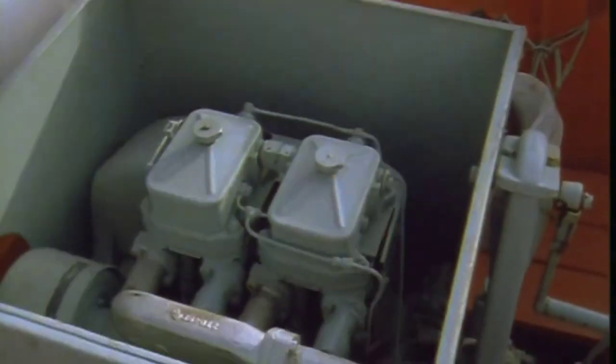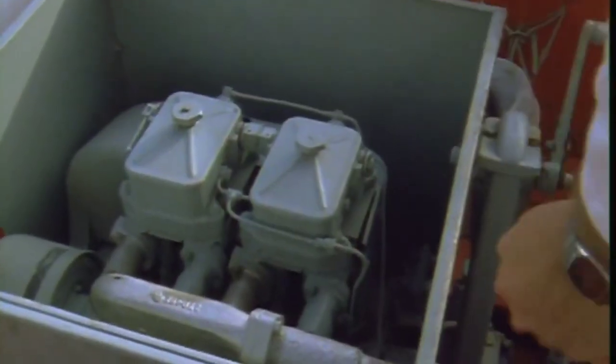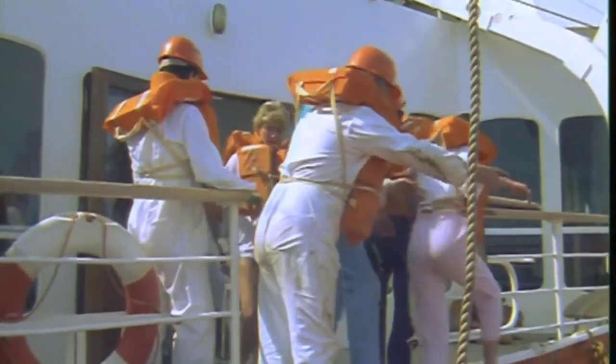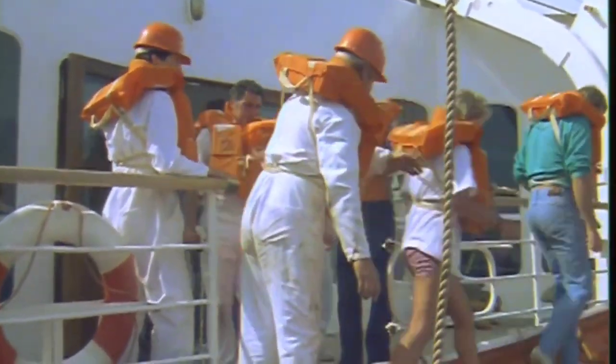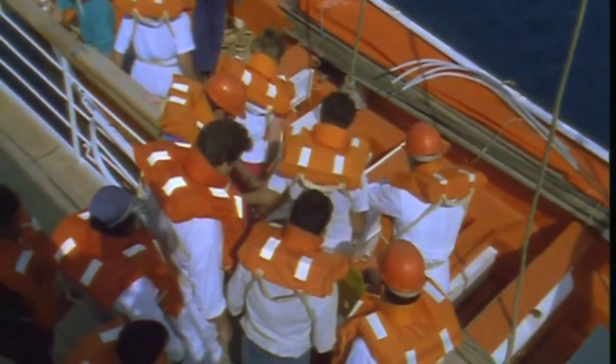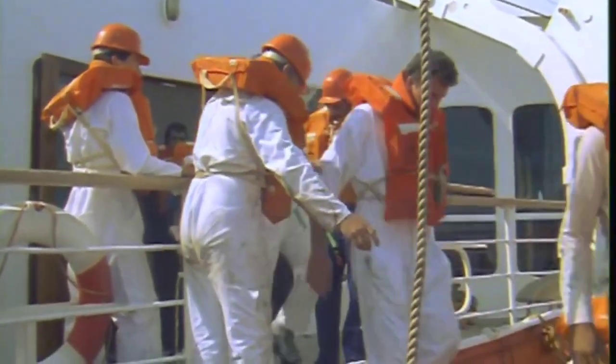Roger. If the lifeboat has an air-cooled engine, this should now be started. Water-cooled engines, which must be able to run for 5 minutes out of the water, are normally started immediately before the lifeboat is lowered from the embarkation platform. Once the order to board has been received from the bridge, the crew assists the evacuees into the lifeboat. The crew members ensure that the occupants sit as low as possible in the boat and that their weight is evenly distributed.